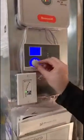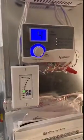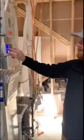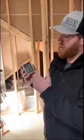On the control panel we've got numbers one through seven. Typically you're going to be in the three, four, or five range. What we're trying to do is hit 35 to 40% relative humidity in the house. The control panel does have a humidity readout — ignore that and go off the reading on the humidistats that we provide. We've got one for each floor; keep them away from windows and vents.